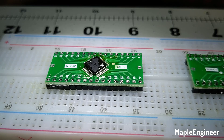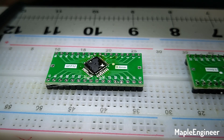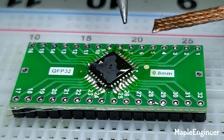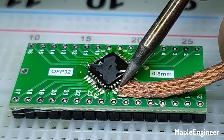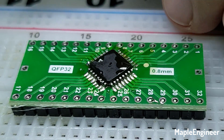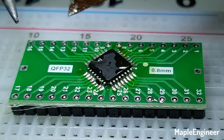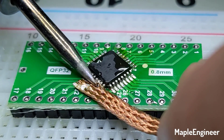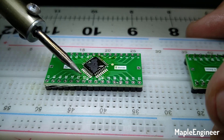Here's my braid. Go in there with a bit of braid and just pull that solder bridge out. This is what you do — you've got a little bit of solder bridge in there, just pull out some braid, go in and get that solder bridge out. I have a solder bridge right here — let's pull that out. There we go, pulled that one out. Let's get this one pulled out, and this one over here on the end. Just go in there with a little touch of braid — there we go, that one's pulled out. On this side we'll pull that one out too.